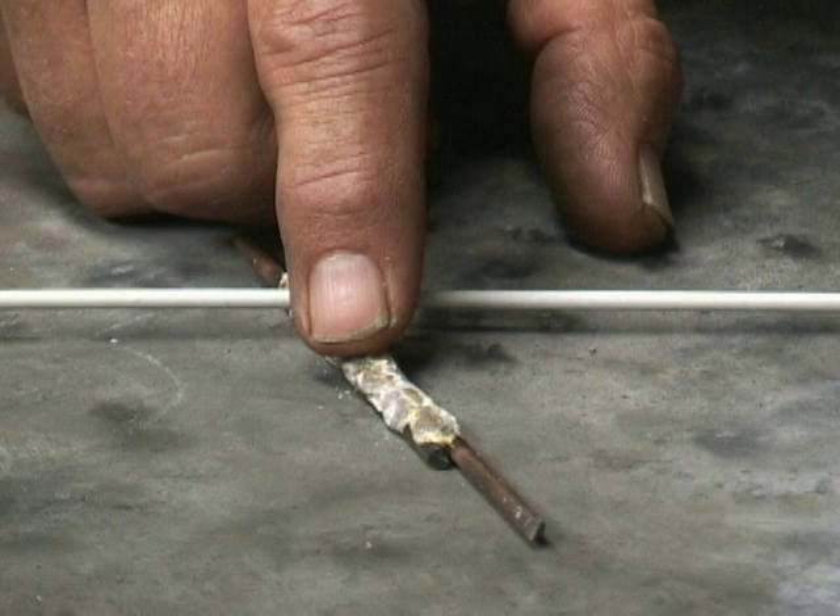That's why I do not use much flux. Plus the fact, when I finish with anything, even though I haven't used much flux, I'll wire brush it to make sure that there's no residual flux on there. One of the reasons I've spent so much time on the flux and cleaning off the flux is because the goal here is to produce pieces that are showroom quality — that you'd be pleased to have in a gallery or somebody's home or office. So it's really important that we get all this flux off and get this piece finished, all cleaned up, so that we end up with a piece that is showroom quality.